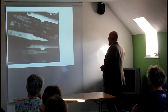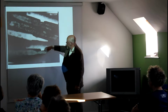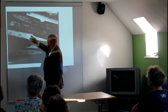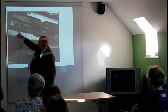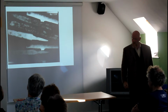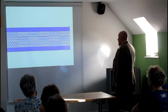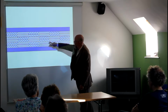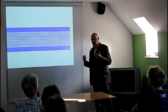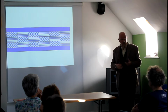Under x-ray, you can see the scarf edging on the sword, 4 strands in there, just enlargements of them. But this is the middle one, and this is where all the pattern welding is. Iron tang, and then we've got an iron core with steel edges. Can't really see much detail on that, but under magnification it's there, I promise you. That's an illustration of it. So you get separate twisted patterns of billets running down the middle. These are all individually aggregated, twisted and shaped metal strips which are put together to make a composite blade.